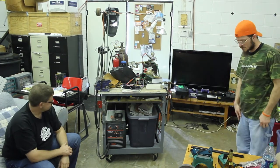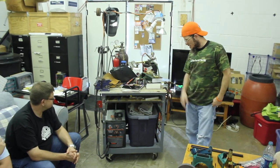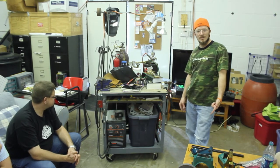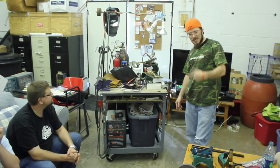That's steel, most of what you're gonna do is probably gonna be steel. With aluminum, we'll talk about that during the fabrication class. You end up using something like wood or a complex table with T-slots in it and little hold down clamps all over the place to frame it up and hold it in just the right position. Then you tack weld it.